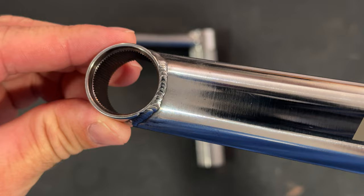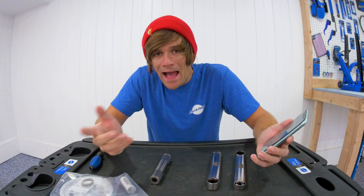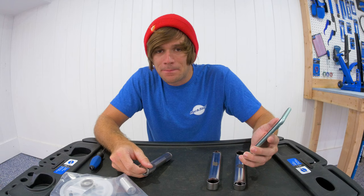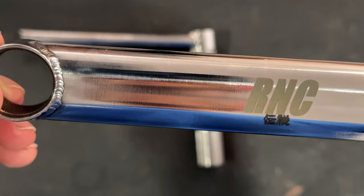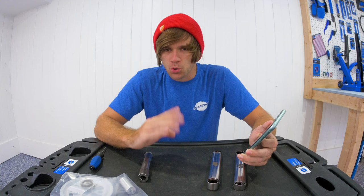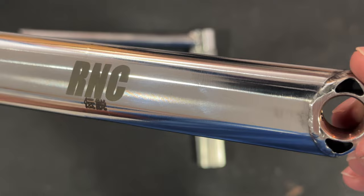300,000 tensile strength. It supposedly has the highest strength of any metal, which sounds like a big deal. It's incredibly tough and ductile even after aging heat treatment, unlike the 4000 series steel like chromoly. And when you think in terms of titanium and how it has a shorter fatigue and shelf life, this maraging steel is incredibly tough even after all of this.